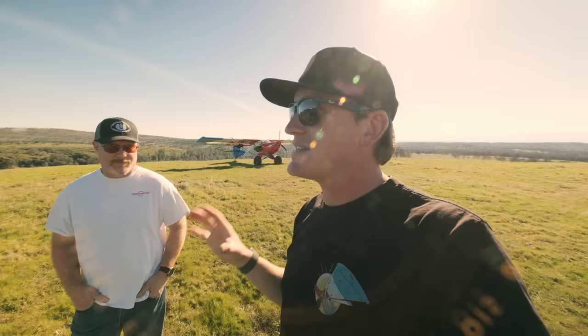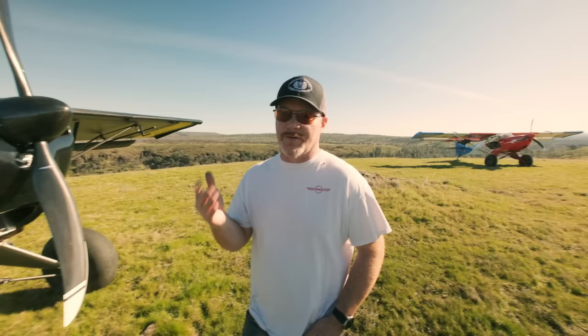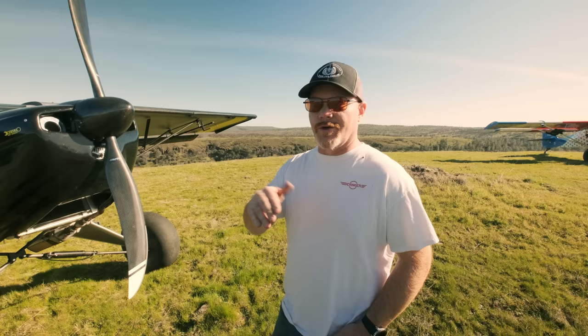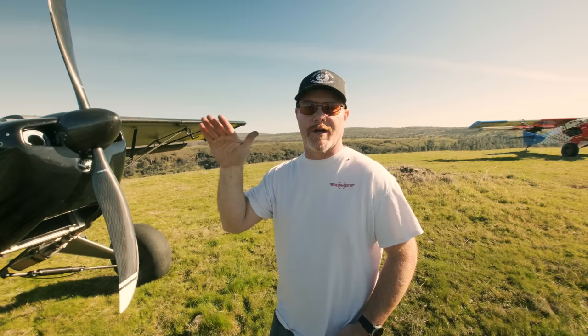Well, and you figure, like you were talking about Ty's plane, it's the same wing on a 4 that's on a 5, 6, 7 standard wing. Yeah. So you think about it, the plane got almost 200 pounds heavier and the wing stayed the same. So I think it is happier with a bigger wing. And you really notice it more as you get up higher in elevation. When you're cruising up above 7,000 feet, it really felt like you're holding a climb all the time with the other wing.